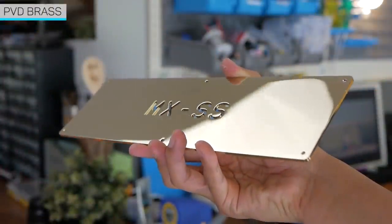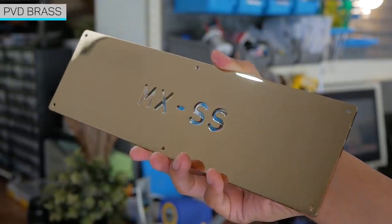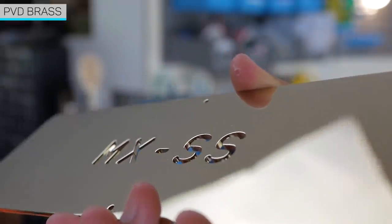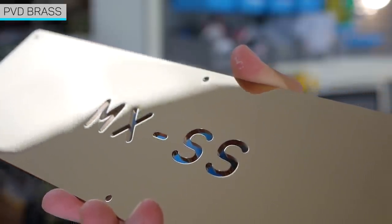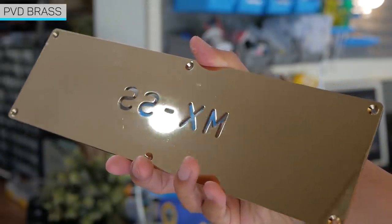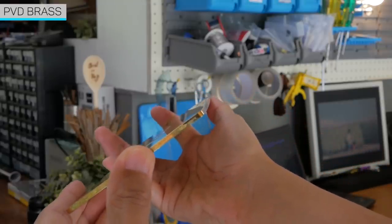The weight is made from PVD brass and is one of the problematic parts of the board. One side of it is finished pretty close to perfect — no real blemishes or scratches — and it looks so nice as mirror finishes are before the fingerprints come. That's the side that faces down onto the table, so it's the visible side. However, the other side, which you can only see when you open up the keyboard, does have those imperfections. But as it is enclosed, the finish isn't a huge deal. What is a huge deal though is the warp on this. It's 3mm thick, so the rest of the keyboard conforms to this shape when you screw it in.